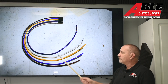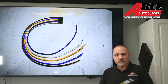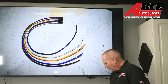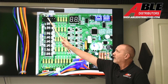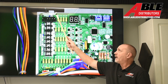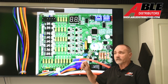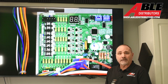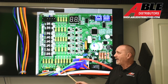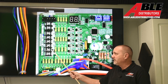There's a little wiring harness from the board to your outdoor unit with five leads. You might wonder why — with a Bosch heat pump you only need four — but they don't know if you're going to use this furnace with a two-stage AC or someone else's brand. That harness plugs in right here: you've got Y2, W, Y, B, and C. If you're doing just a Bosch heat pump, you don't need Y2 — cap that off. Also new to the 454 version is the B terminal, so now you have a dedicated place to land that wire. On older versions we just used a wire nut from the thermostat to the outdoor unit.